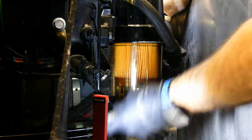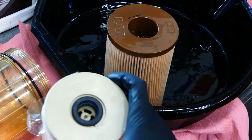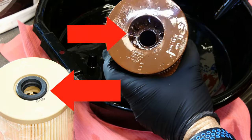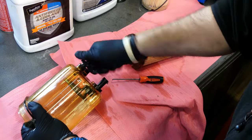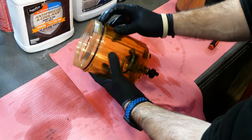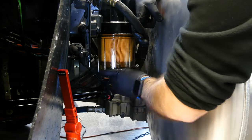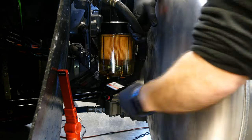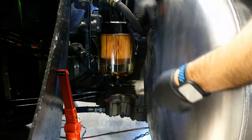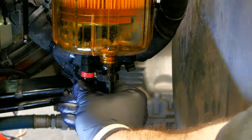If you have a sensor at the bottom of the bowl make sure you disconnect it at this time. Spin the bowl off and get the filter out of there. There are a couple different designs for the PACCAR fuel filters so make sure you get the correct part number for your truck. You can see here that the top cap of each filter is different and they cannot be interchanged. You can tighten your drain valve now and then go ahead and replace the o-ring. Install the bowl and the filter up onto the base and then start threading it down. Once the bowl seats on this PACCAR style filter, the ribs are spaced further apart than the DAVCO's, so don't try to get three additional turns after it gets tension — go for one and a half or two instead. Just make sure it's secure and won't leak. Don't forget to reinstall your sensor connector if you have one.